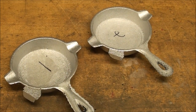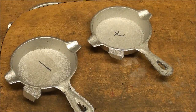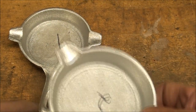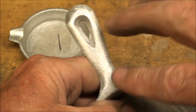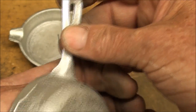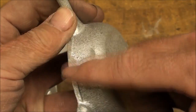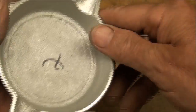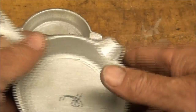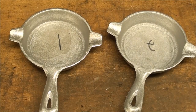I'm going to start cleaning these up now, off camera, because this is going to take quite a while. I've already been at this for four hours. I have spent exactly 45 minutes between the two of these, cleaning them up, taking them to the parting line so they look pretty true. I cleaned this up a little bit with emery cloth — fairly smooth. Now we've got two of them ready to use as patterns.